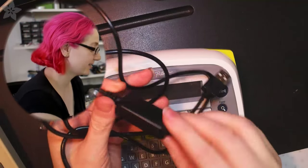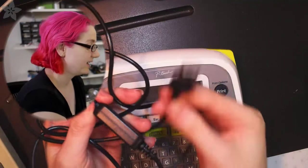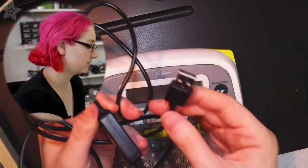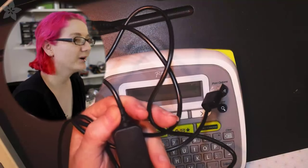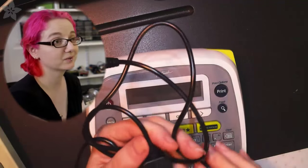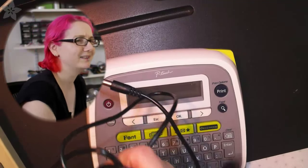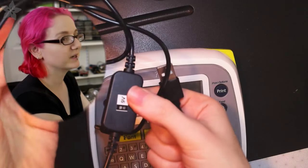And there's a little boost converter in here, and it's like 85-90% efficient. It can supply up to an amp at 9 volts. It draws 2 amps from here. It's totally not USB spec compliant, but boy, is it handy. If you have a USB powered hub on your desk, which I do, it's kind of nice. I don't have to reach under my desk anymore to plug in wall adapters. And then you get them in 9 volt or 12 volt.